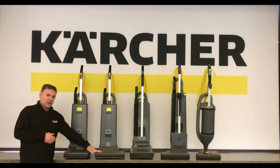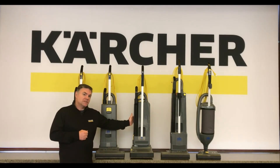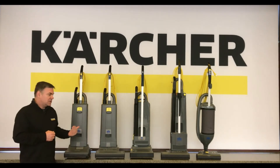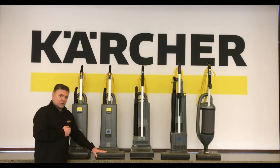These two vacuums have been in the lineup for a great many years with great success. They have a lot of commonality in form and features — they're modular and about 95% of the parts between the two are the same and interchangeable. The big difference is the Sensor XP automatically adjusts its brush up and down to whatever surface it's cleaning, while the Sensor S is a manual version of that. More recently, the Sensor 2 was added to the family — a more mechanical model that avoids advanced electronics to monitor airflow and brush agitation. All three Sensor units are single-motor upright vacuums, use the same bag, and use the same microfilter.